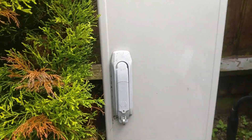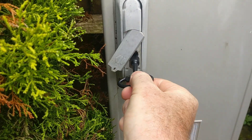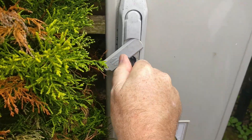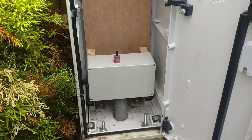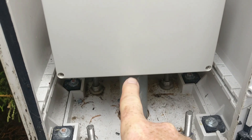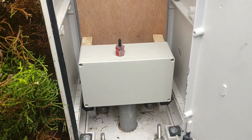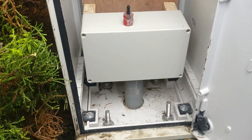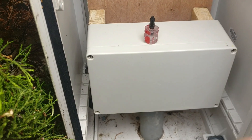I'll go ahead and unlock it so we can have a look inside. You pull this to one side — it's a bit difficult with one hand — then you put the triangle key in, turn and open. Inside there's quite a bit of room. There's some wood at the back which is about 15 to 16 millimetres thick so you can screw things to it. At the bottom there is about 40 millimetre conduit coming up to a junction box — this is the DIN rail terminal junction box from an earlier video. Inside everything is further protected here.